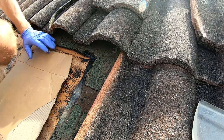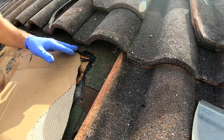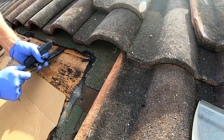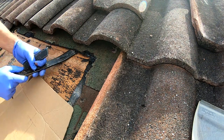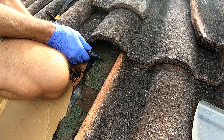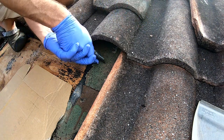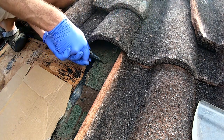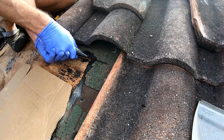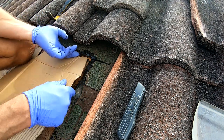When I'm fixing this area, my roofing paper is going to go underneath this layer, so you want to double-check that there are no obstructions underneath so you can slide it under. Then I'm gonna make a cut right here. The layer that I'm going to apply is going to go over this one, and I'm gonna put roofing cement underneath this area to make sure I have a tight seal.